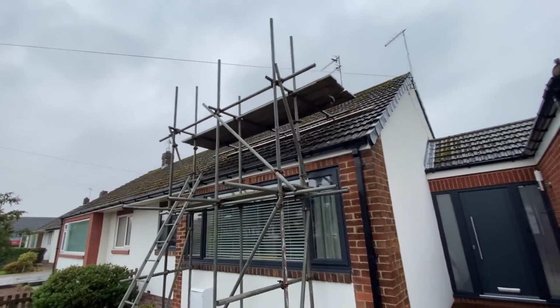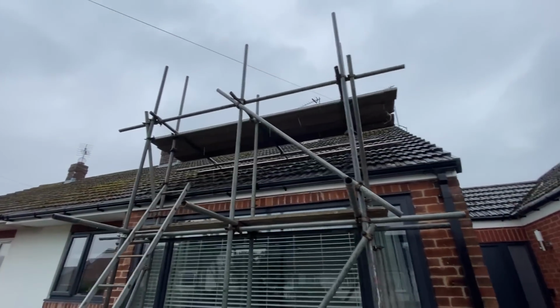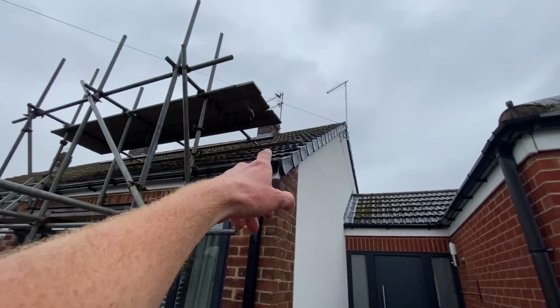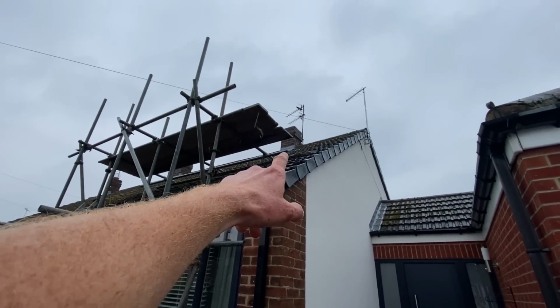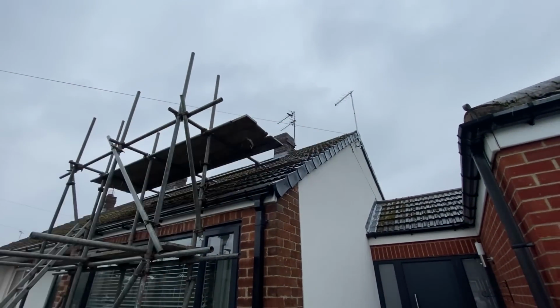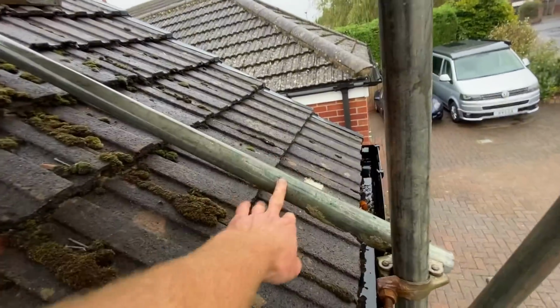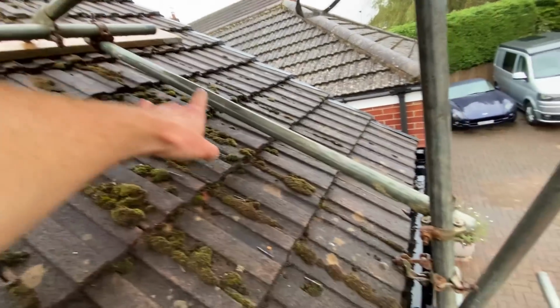Right, that's what we're looking like from the bottom. Some boards on there to work off. I'll now punch up off that very inside ledger and needle into the roof again. Actually, just quickly before I do that, I've just put these breakers in, bracing up that inside ledger down to this inside standard on both sides.